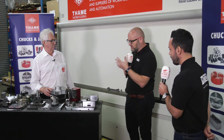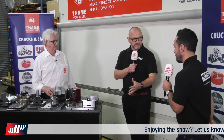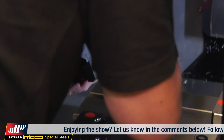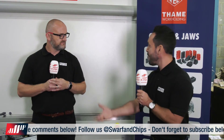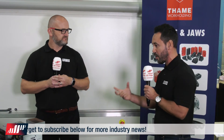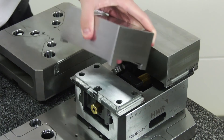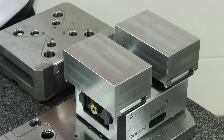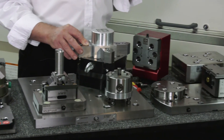Why do you think it's overlooked? We see every week hundreds of thousands of pounds spent on the world's finest machine tools, and you get there and there's one vice. Why aren't people looking at Zero Point and more modular systems? I think it's overlooked because they can do the job without it - but that's not to say they can't improve the process with it. It's not until they start looking at efficiency gains that they start investing. You can present more components to the spindle, save on set-up times, and completely revolutionise the way you work - whether it's a round part or a prismatic part. It gives you complete flexibility.